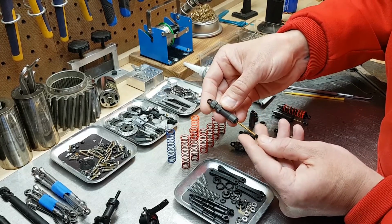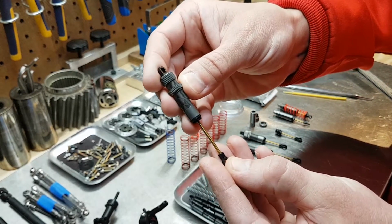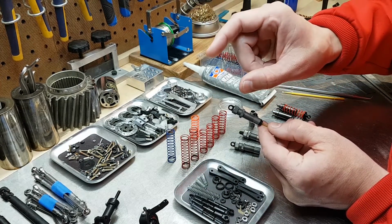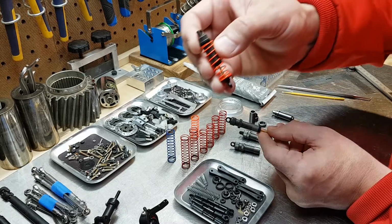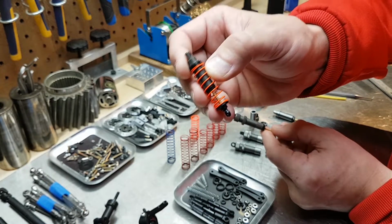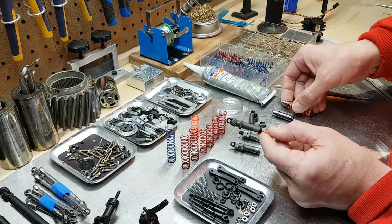If you remember from previous videos, I'm using the 16 scale mini rock crawler shocks from Losi. The rears, however, are a bit shorter, so I'm combining them with a pair of their short course or buggy shocks. And I'm using the shafts and a few other parts from those to make a shorter set.